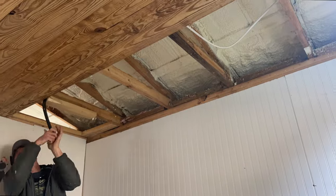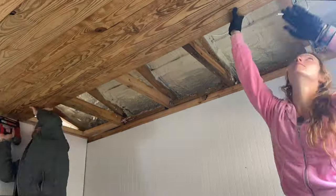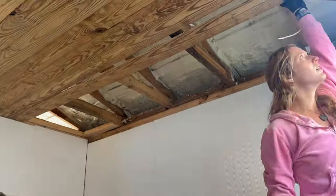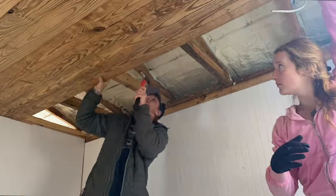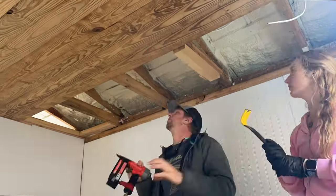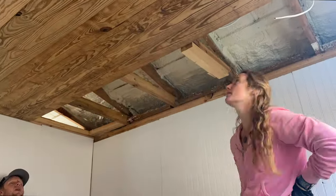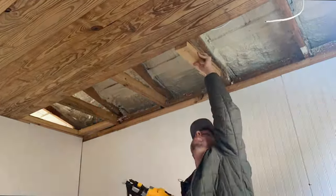When a board of wood is ever so slightly bent, you can still pry it into place to a certain degree. So that's what we started doing, which right off the bat slowed us down, but our ideal timeline was the least of our worries. The real problem is that if the wood is so warped that you can't get it perfectly straight in line, every other piece after that will be slightly off too, and progressively more so as you go along.